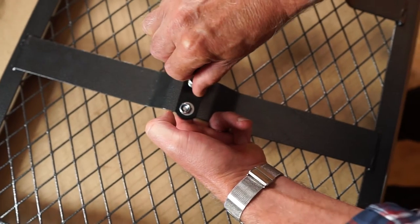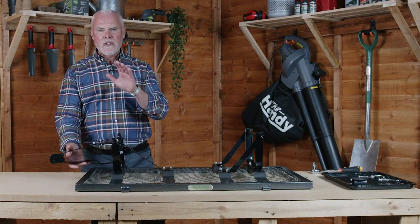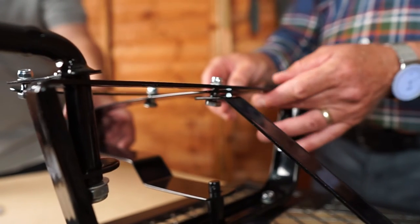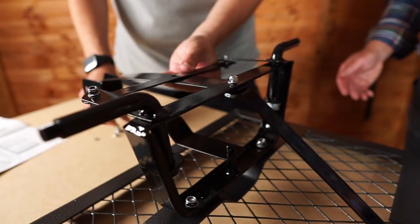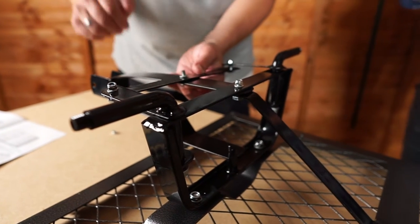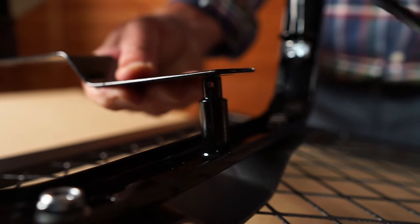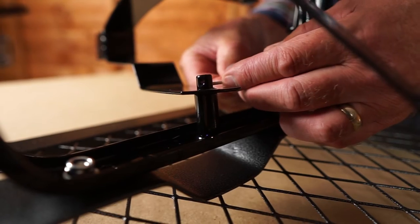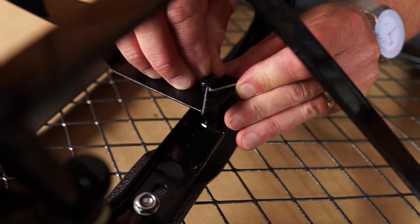We've now attached the central front axle brace like so with the bolt to the base frame. This is the part known as the yoke. Make sure when you construct it the top part of the yoke is sandwiched between the top of the front chassis and the brace like so, and remember to use the large carriage bolt here and the smaller carriage bolt on the right hand side. The base part of the yoke very simply fits over the leg by dropping the hole over like so. We've now put the split pin through the top of the leg and opened it up like so to secure the base of the yoke in position.